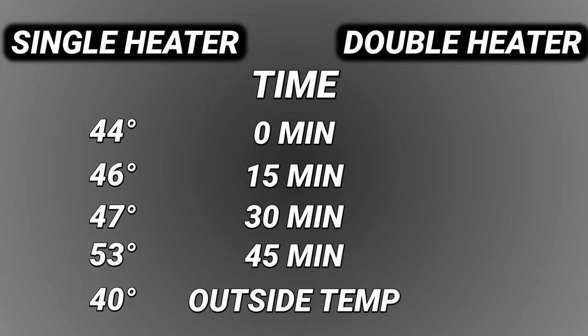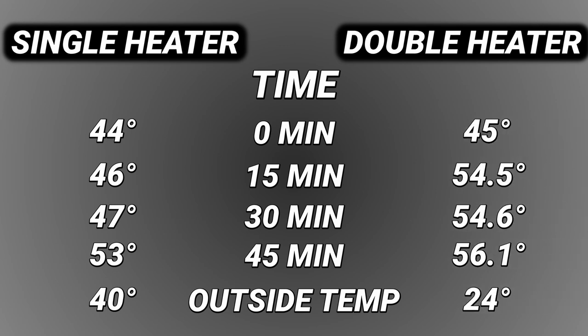If you have a space where you don't park your car, you could leave the heater on and set it to a comfortable temperature. When I originally started this garage gym, I was stuck with space heaters because I didn't have the bigger outlet. When you don't have that option, I recommend having two space heaters on two separate breakers, since these heaters pull about 12.5 amps and outlets are rated for about 15 amps. I'll show a comparison of single vs. dual space heater performance when it was 23 to 30 degrees outside — just make sure each heater is on a separate breaker to prevent tripping.